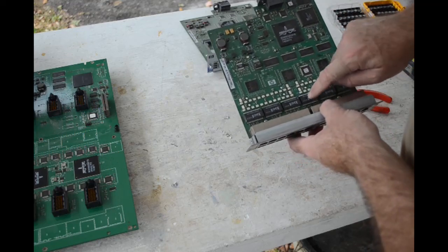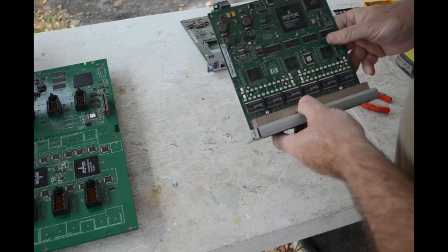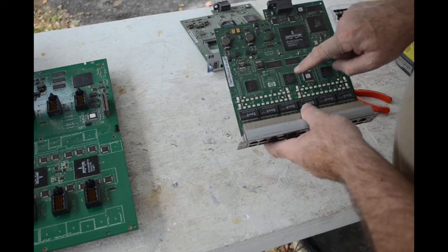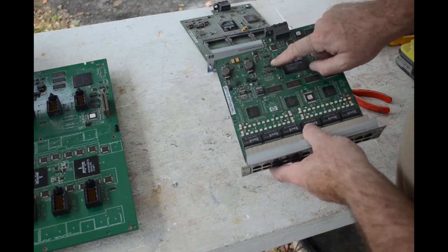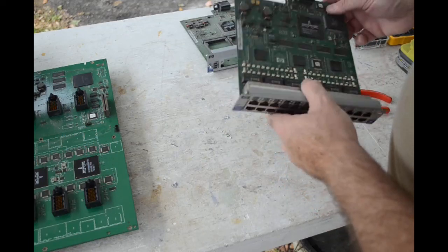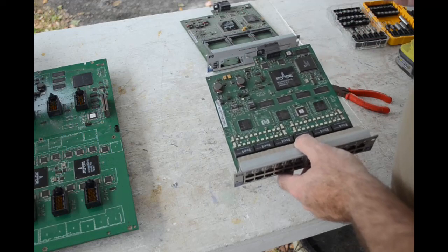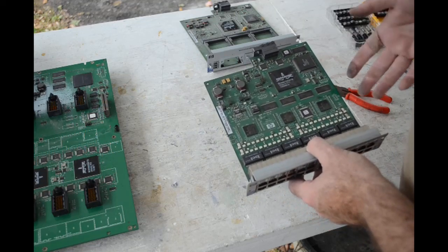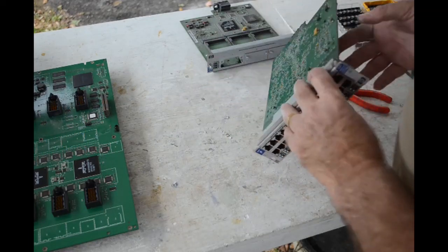What do I want on this board? All the IC chips of course. These are not IC chips — these are magnetics, they've got little transformers in them for the RJ45 connectors. But there's a great big Broadcom BGA chip, one two three little Broadcom BGA chips, a lot of smaller IC chips, some gold pins here, and a lot of gold pins back here — I want all this stuff. Most of this should come off in the kiln without too much trouble since it's almost all surface mount. I depopulate my boards in the kiln: I put the board in, increase the temperature slowly up above the melting point of solder, then shake the boards and everything just falls right off — it's a really great easy way to depopulate circuit boards.